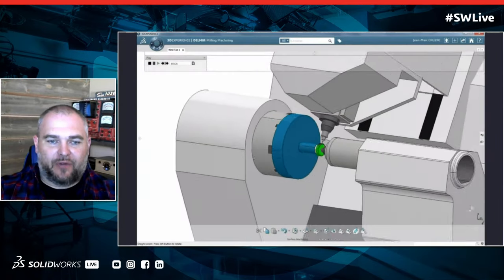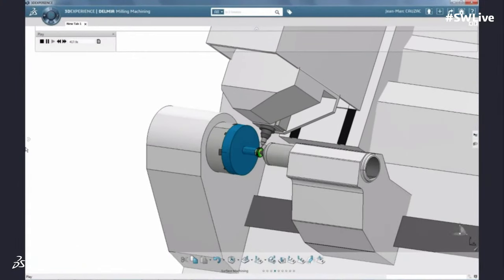So if we take what we started with SOLIDWORKS CAM of turning that outside piece, we're now adding that live tooling and B axis to it so we can actually machine those gears. I mean, that's really cool. You're doing the machining operation on that turning spindle. One of the things I look at when I do this, are there ways that we can improve both our efficiency and our precision with DELMIA when we look at turn parts like this?